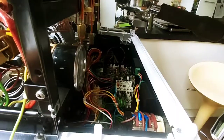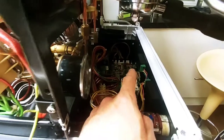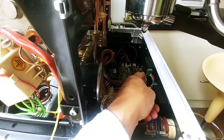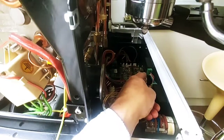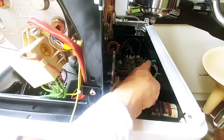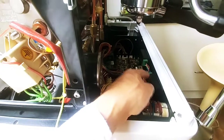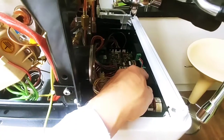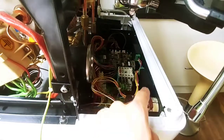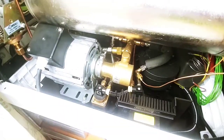What I did is I used the signal coming from the CPU board over here, and that signal was an AC signal — 24-volt AC. It's been converted with two transformers over here, one for each group, which is important because you can't combine them. The output of this signal is actually a DC signal. This DC signal drives an SSR over here — a solid state relay — which in its turn switches our rotary pump.